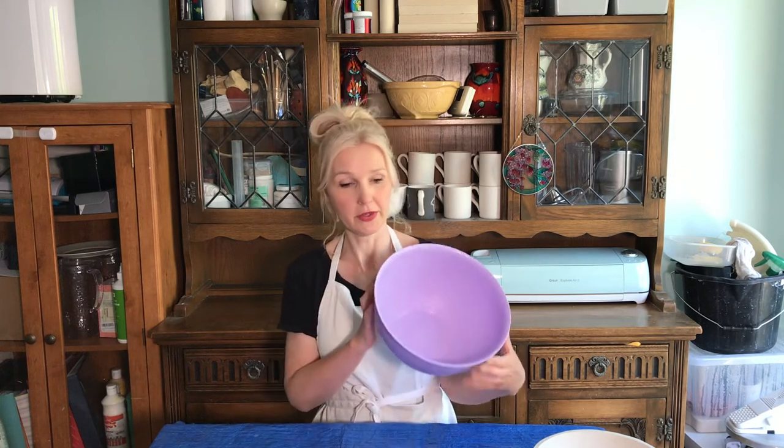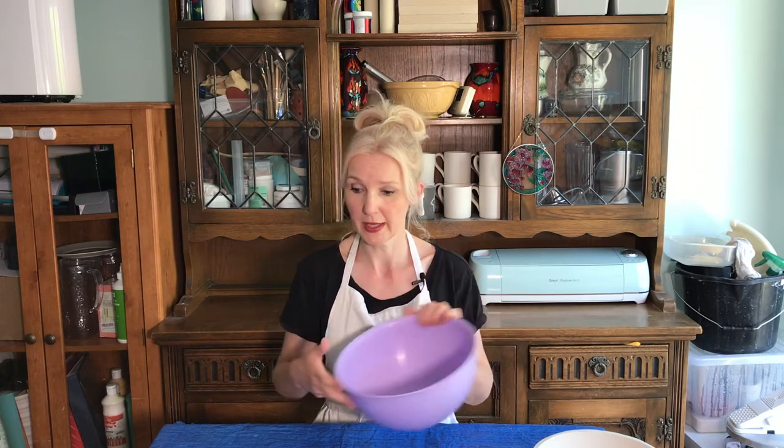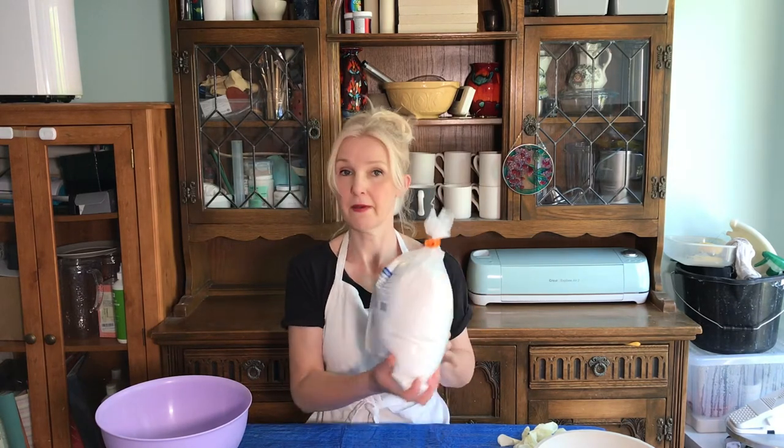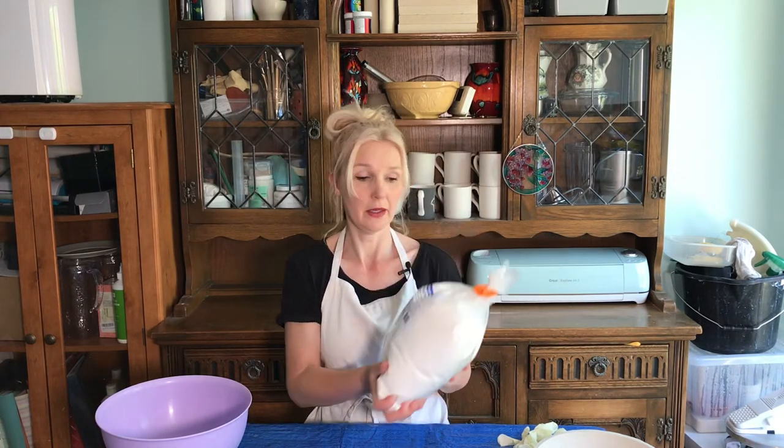What you're going to need is a bowl of some kind — a plastic one that flexes just a little bit. You're going to need some rubber gloves, some release agent (Vaseline is fine if that's what you've got), and a little mask. You need this plaster — this is fine casting plaster, though you can use plaster of Paris as well. You're also going to need a bucket to mix it in. Let's get on with it!